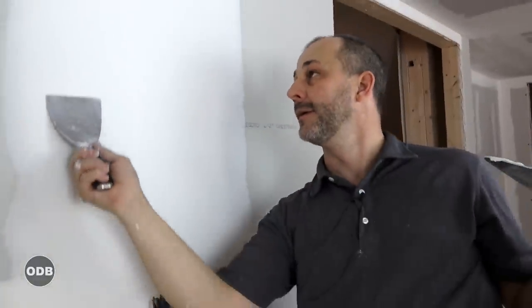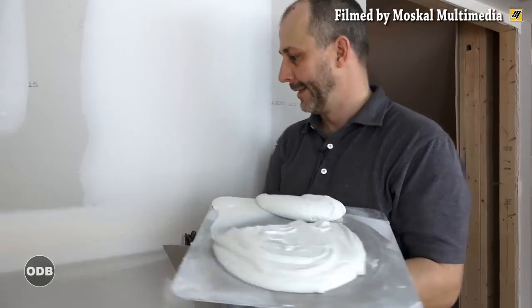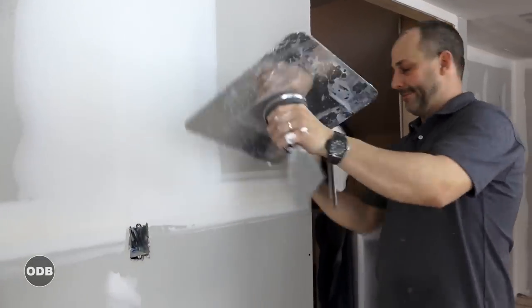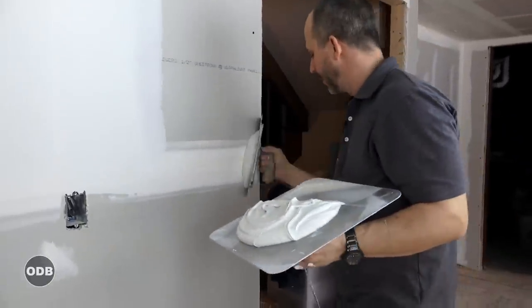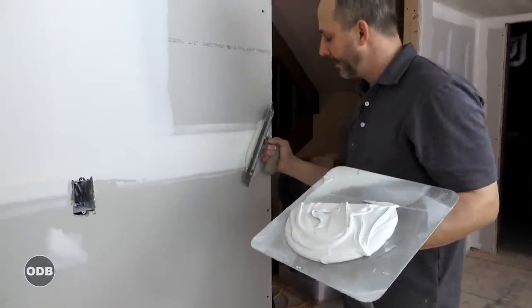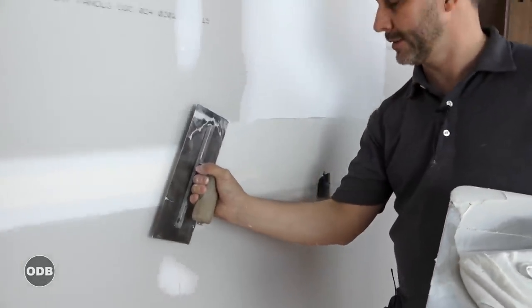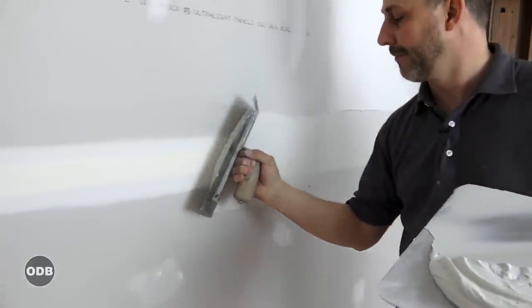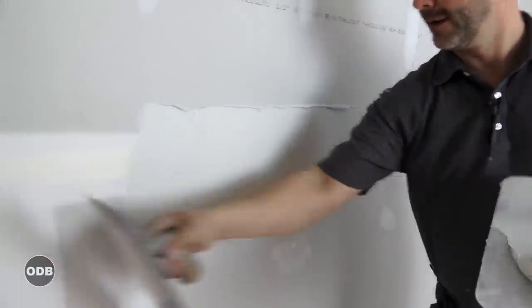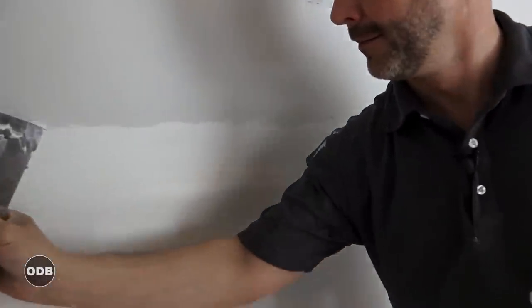Okay, this is all I do — don't need to sand. Now we're ready to mud. We're going to take our mud on our ten-inch trowel, slap it on, put an angle on it, put pressure on the bottom so we're constantly forcing the mud up. Don't do anything special around those plugs and switches, just keep on filling. If you do it that way it's not going to end up all over the floor.